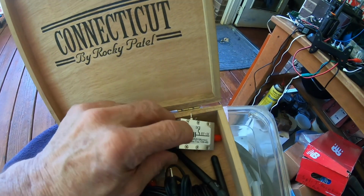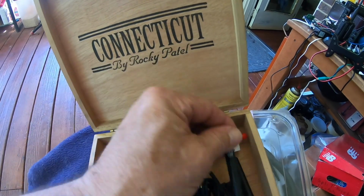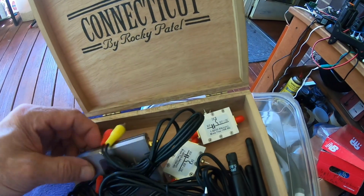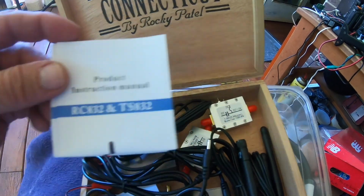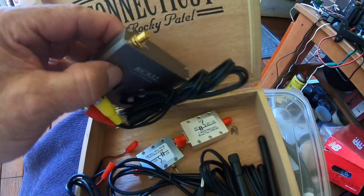And that's a bias tee right there. And bias tees allow you to put 12 volts on the RF line going up to the antenna, so you can put a receiver with another bias tee and pull the 12 volts out and power it at the top of the tower so that you're getting the best signal to amplify.